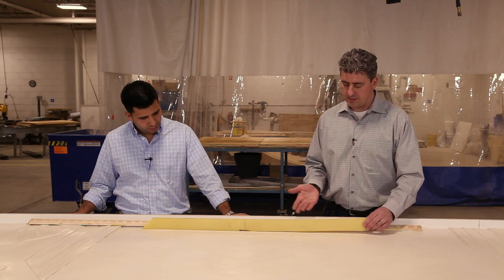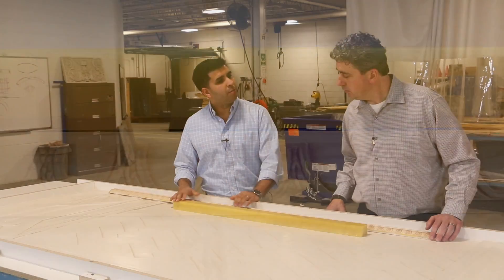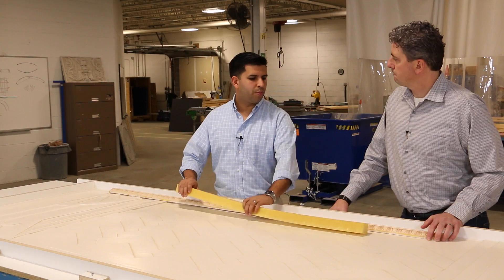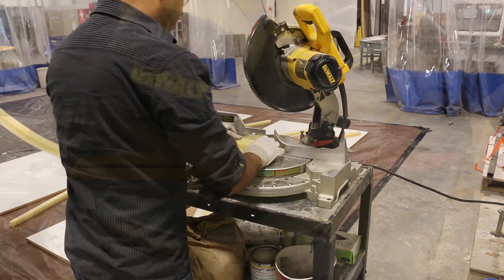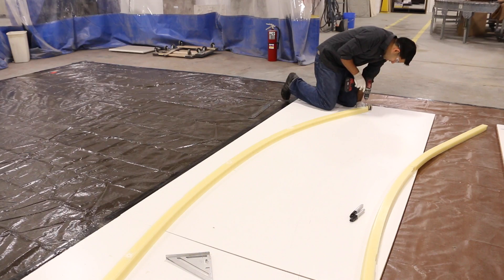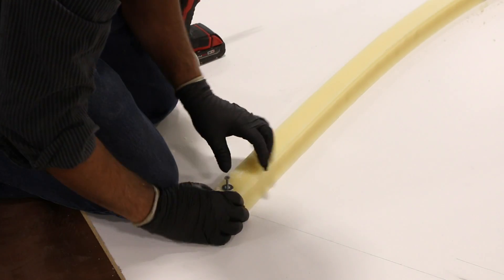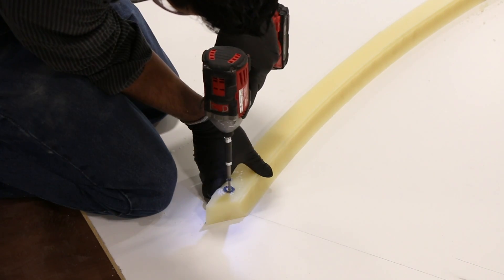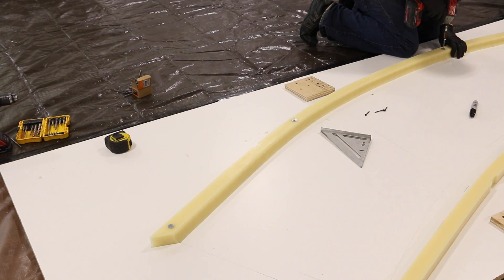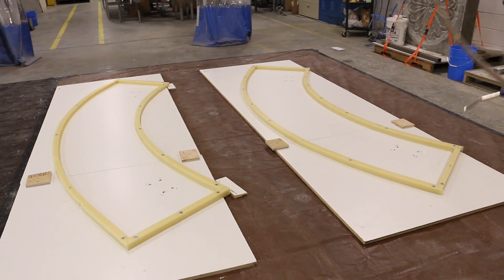All the detail came from the original piece of trim, so now you're ready to start making concrete countertops. You could put it in a box, but the great thing is that the rubber is tough enough to hold its shape. We actually cut them on a miter saw, drilled through them, and screwed them onto the base — matching the curve and dimensions needed — and matched that curve perfectly to the base on site. The countertops are in fact curved.